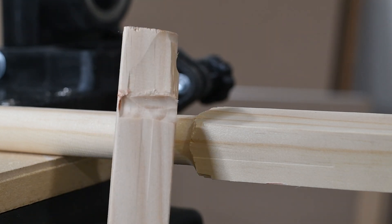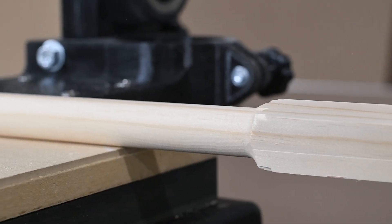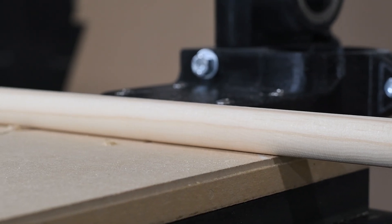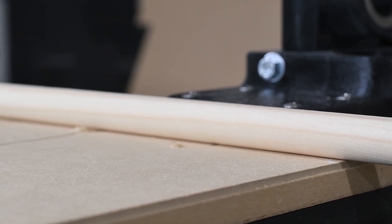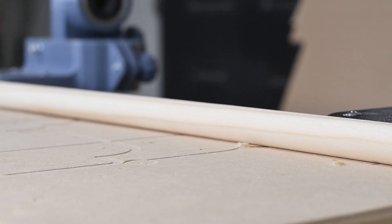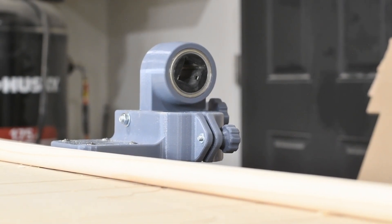For reference, this is the first one we cut today — it's pretty good, but there's definitely room for improvement. Behind it is the second one and it turned out really good. There's a little bit of bumpiness in the surface, but really it's very good. I think I could get rid of some of that bumpiness by making the design a little stiffer, adding material, and increasing the infill. I could also change how the bearing block clamps into the bracket to make it more rigid. Oh — what's that? That must be another design I did. Let's talk about that and give it a test.